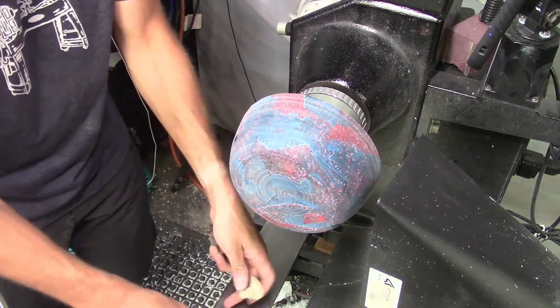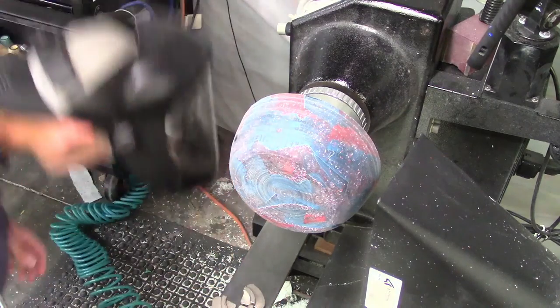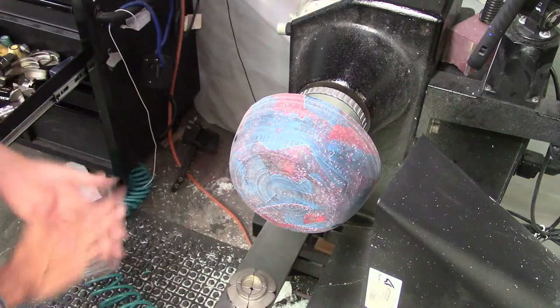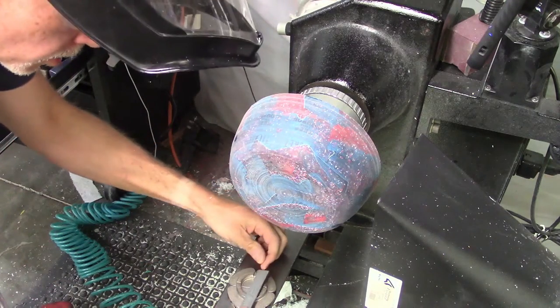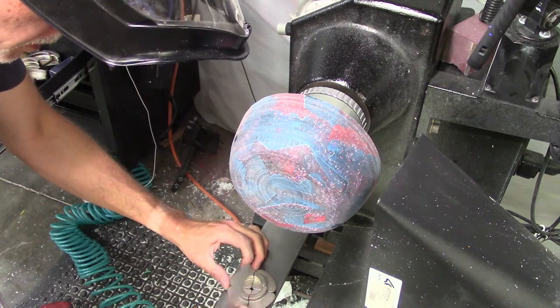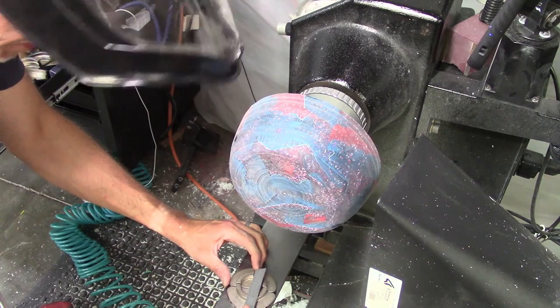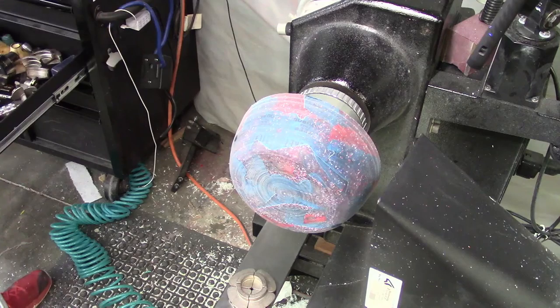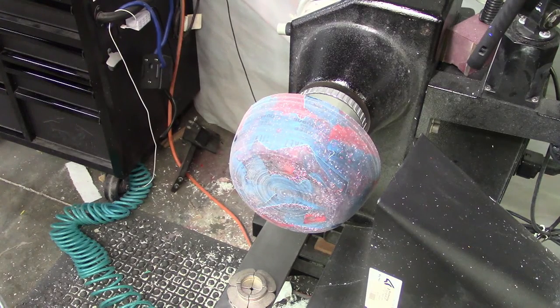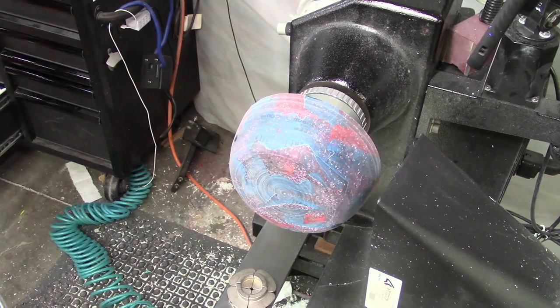And I always forget the diameter of these things. I think it's an inch and a half, but best to just double check and see how far we need to go. Oh, a little bit over 2 inches, because they're going to expand. So I'm going to put this in expansion mode, probably go about 2 1/4, maybe 2 1/8, something like that. So I'm going to grab a 2-inch Forstner bit. I think I've got one. That'll make things fairly easy. I can just nibble away some of the extra. Where's my 2-inch? Thought I had a 2-inch. I have one somewhere.